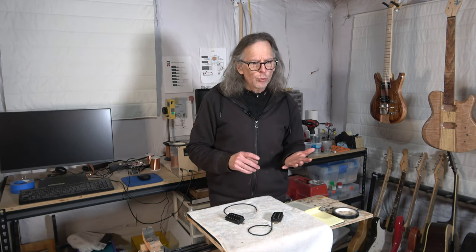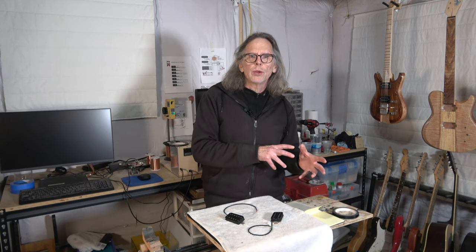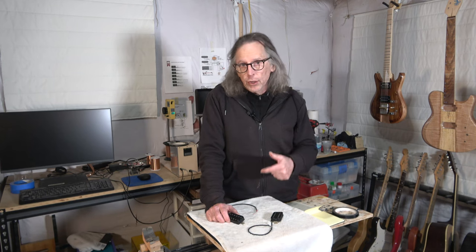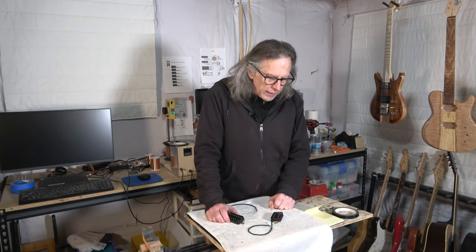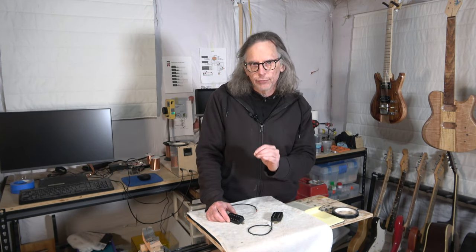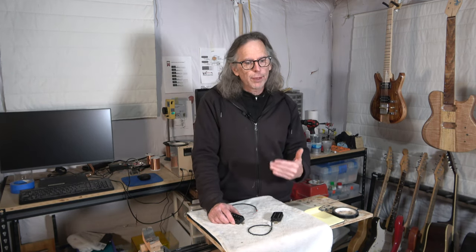Typically, I'll use Alnico 5 if I'm pretty confident that the DC resistance is going to measure somewhere between 8,000 ohms and 12,000 ohms. That's a good space for the Alnico 5. When you're below 8,000, you can select between Alnico 2, 3, or 4. Those magnets will work pretty well. Each one will offer a slightly different tone, so you've got to experiment to see which one gives you the tone that you like. Now, if the pickup I wind is over 12,000 ohms, then I have to start looking at either Alnico 8 or Ceramic 8. That's because over 12,000 ohms of DC resistance, there's a good chance I'm going to lose a lot of treble frequencies, and those stronger magnets will help preserve those treble frequencies in the outgoing signal. That prevents the high output pickup from sounding too muddy.